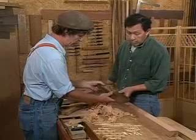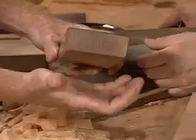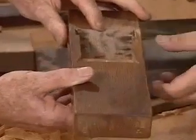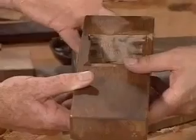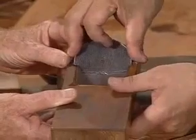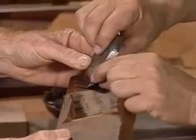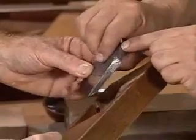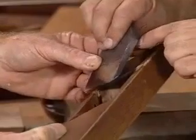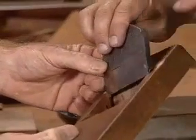They're made either rift sawn or flat sawn, and you can see the ray pattern. Yeah, the ray pattern. So here's the bark of the tree. The bark is out, and it doesn't have a wedge. It just goes right in. Each one, you'll take your iron and hand fit it to each dai, each body. And the iron is wedge shaped in this direction, so you create a wedge shaped bed that fits it exactly.